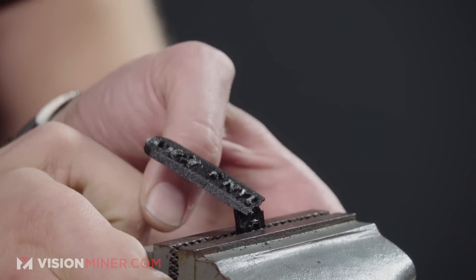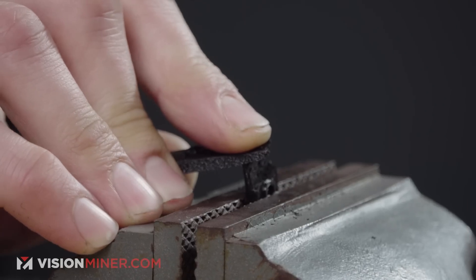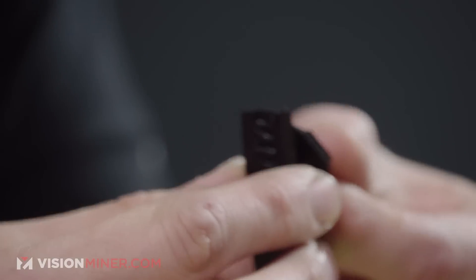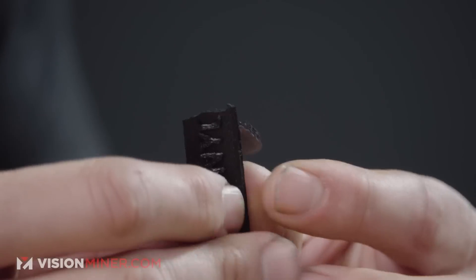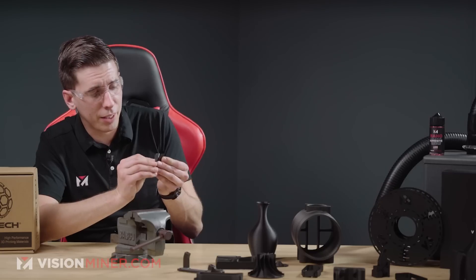I'm putting the bar in the vise and pulling back on it to see if it explodes, bends, or what. It had a hard break but stayed together. Looking at how it broke — it did break across the layers there, so we might print these a little bit hotter, but overall it wasn't directly along the layer lines and it stayed together a little bit, showing some of that nylon ductility. It was very, very stiff even compared to a lot of other high-temp materials without the carbon. This is 10 to 13% carbon — we'll do other tests on other percentages very soon, up to 25%.